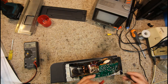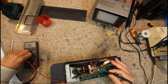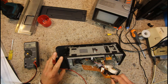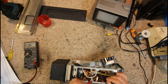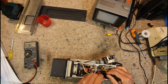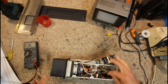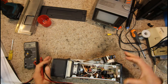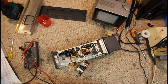We'll disconnect the picture tube socket and measure across the horizontal output transistor. Now we're up in the mega-ohm range, good. That brown wire must run down to our heater in the picture tube going to earth. Checking the heater pins — well there's a short there: 33.5 ohms. So that's our heater — that's the only short circuit in here by the look of it. So it may just be a faulty voltage regulator. I'll connect the tube back up.